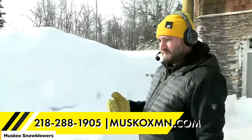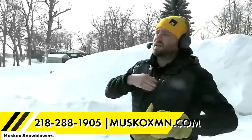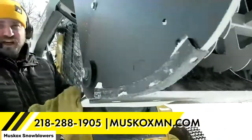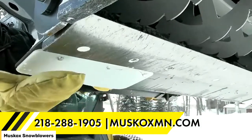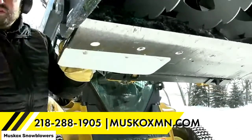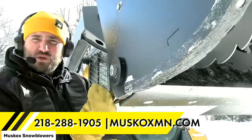Ron, if you want to lift up the machine, and I'm going to get underneath and show you guys our glide plate and our steel cutting edge. We look at the glide plate, talked about that earlier. It's about 585 square inches. This is the glide plate right here. We double down by being able to ride on the cutting edge. So when we're in our forward position, this is what we're riding on rather than the tip of one single little steel cutting edge. This is our natural ride position.